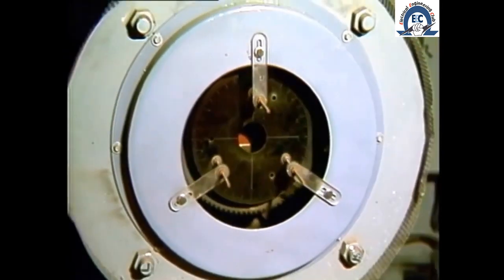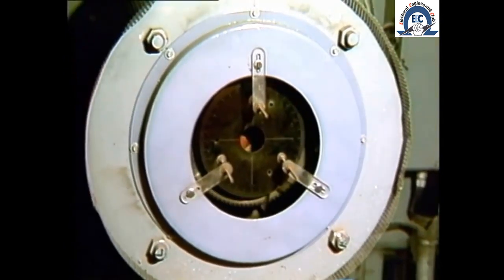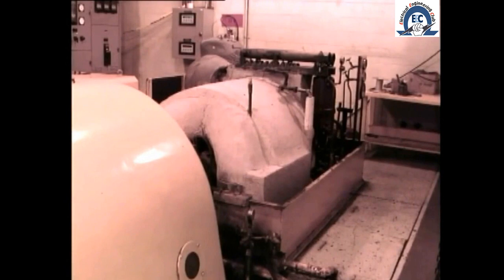The unit should remain on turning gear for several days at least. Operation of the turning gear after shutdown is so important that in the case of a failure of the equipment — say a motor failure — then drastic action must be taken. One method adopted is to rotate the shaft by hand if possible.